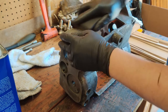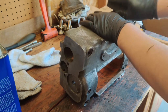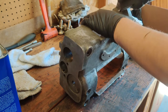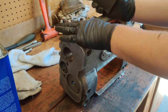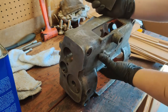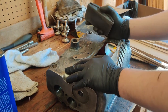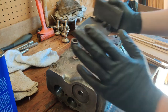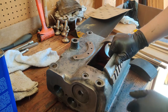I've just been going at this a little bit with sandpaper, cleaning up some of these edges and corners where the casting was pretty roughly done. And otherwise getting this really nice and cleaned up — once that's all been done, I'll go over this with a rag with acetone and clean up everything else, then start hitting it with the body filler.